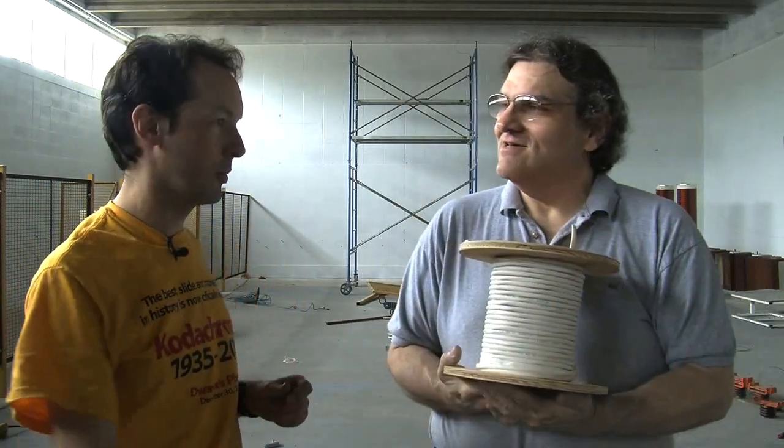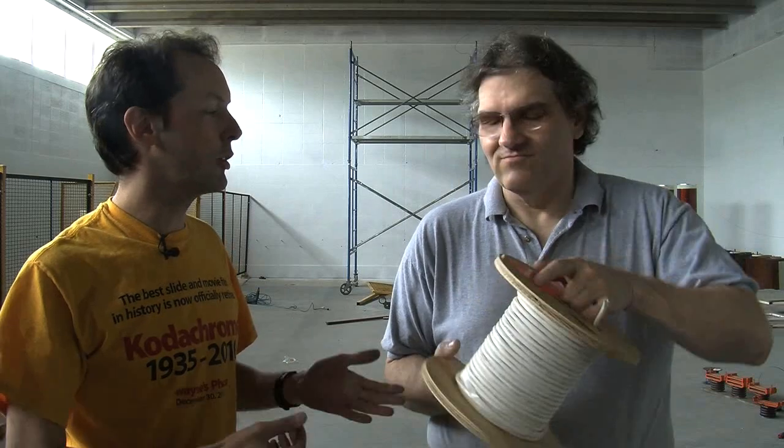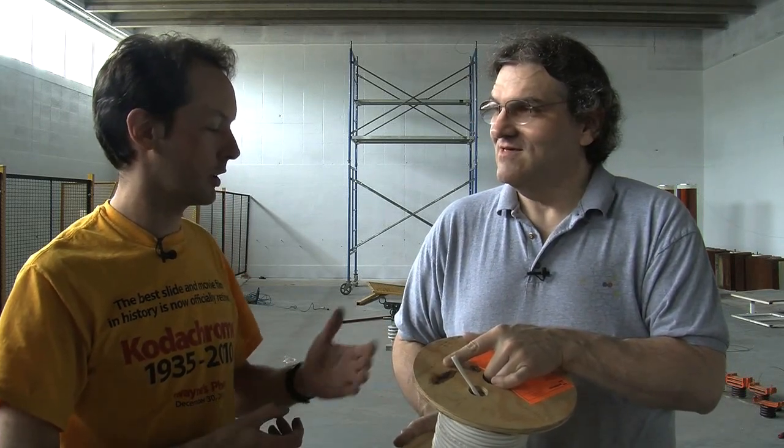We've got the variac cabinet over there and the control cabinet over there. My job is to run the conduit around the corner. We can probably pull this off in three-quarter conduit — I wanted to do an inch and a quarter, but our wires are now much tighter and better. Do you think you can get two of those plus six 12-gauge wires through a three-quarter inch piece of conduit? I think we can cut off six inches of it and test.